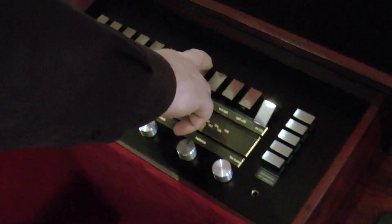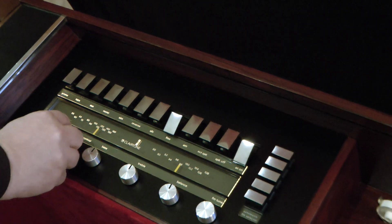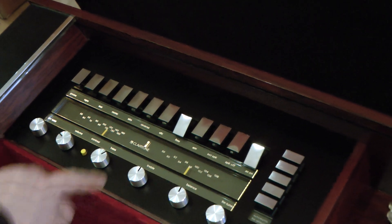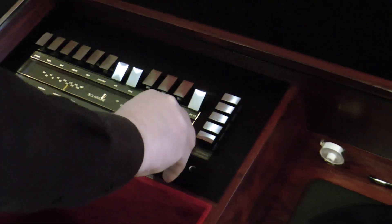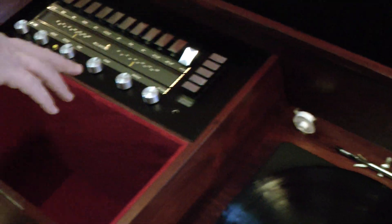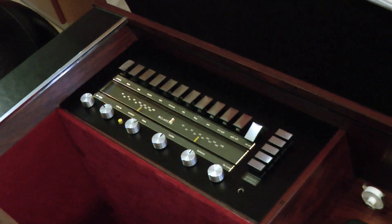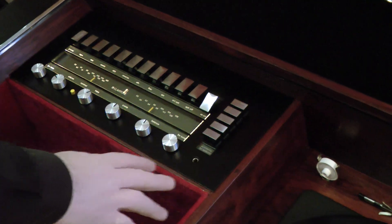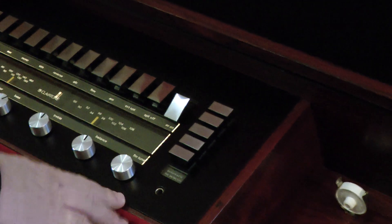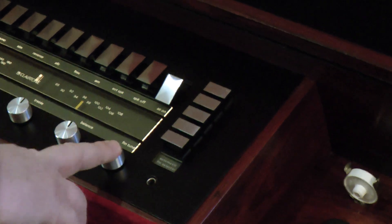Let's start with the FM. FM on, tune into a channel. And here's the AFC. Notice at first I had the FM only and it was very staticky between channels. When I put the AFC on, it was jumping clearer to channels — that's essentially what the AFC does. These presets for the FM we never use; they're old and can cause problems with the tuner. We recommend not even using that section. When you want to tune something, just use your FM tuner.